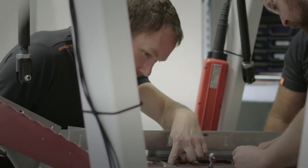Bear in mind there's a lot of weight to fit into these bulbs, but also consider where you're articulating the flaps from. It's done by battery which feeds into a hydraulic system that comes down the foil arm. Are you housing mechanisms in the bulb and turning the flaps from there, or taking the hydraulics out into the foil arms and articulating flaps at that point? There's definitely a philosophy around the mechanical engineering as to how best to streamline the whole system.